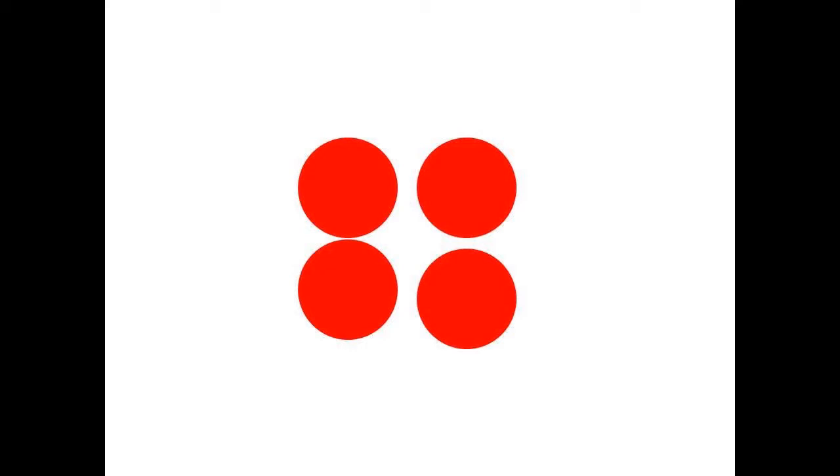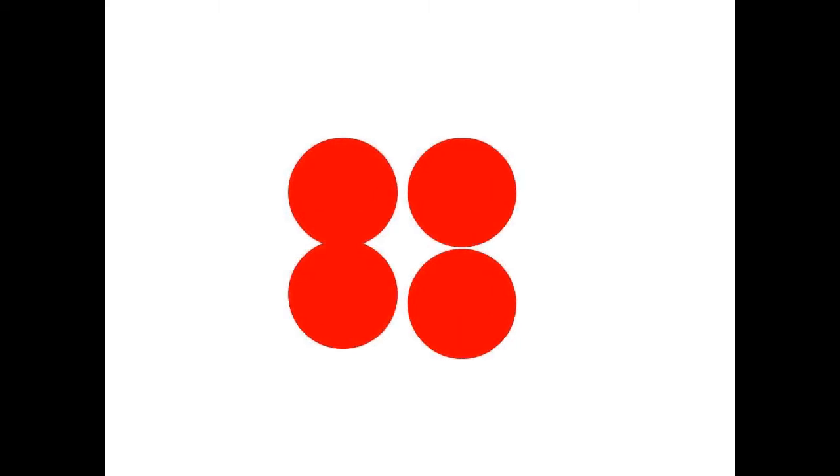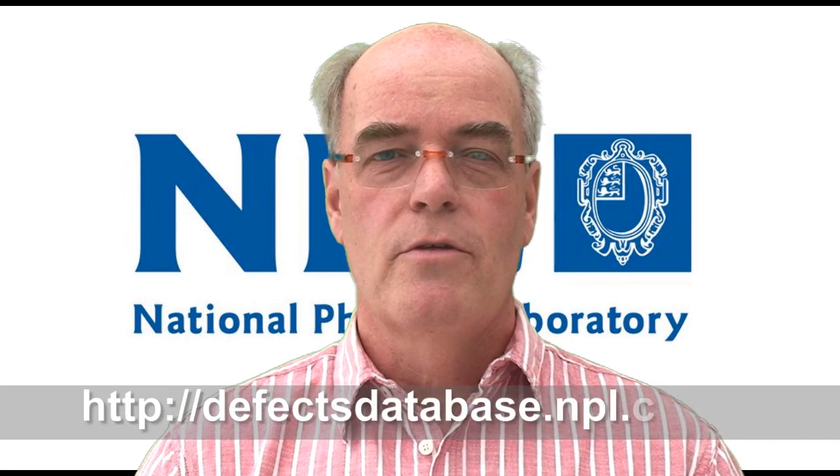When we look at adhesives we could obviously measure the dot size and height, but an interactive pattern works very well. If you have two groups of two dots — one group with a gap between the dots, and one where the dots are just about touching — as the adhesive volume goes down for whatever reason, both sets of dots won't touch anymore. If the adhesive volume goes up, more likely with dispensing, then both sets of dots will touch, giving you a very simple inspection and process control method to monitor your adhesive.